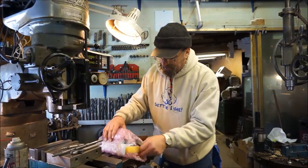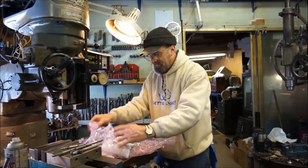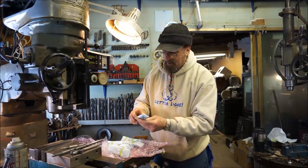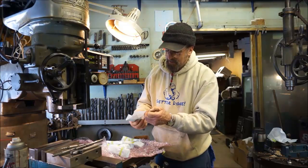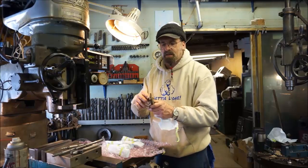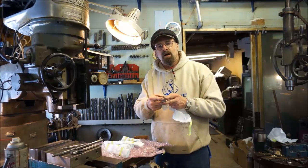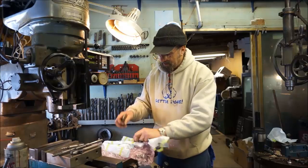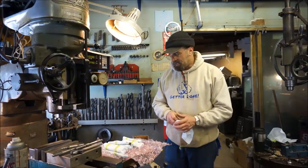I'm not going to open and go through this whole thing here, but I just want to show you that I am opening it, made it here safe. Everything was individually wrapped. These are probably some offset straight in notching or groove cutting. Yes, very nice. Actually, I like these, and I like to radius these for coming in on the root of a thread where you've got a thread relief behind the thread, and you give it a little bit of a radius. It's real nice to shape that out. All right, I'll open these up and I'll go through these. I thank you very much again, Dana.